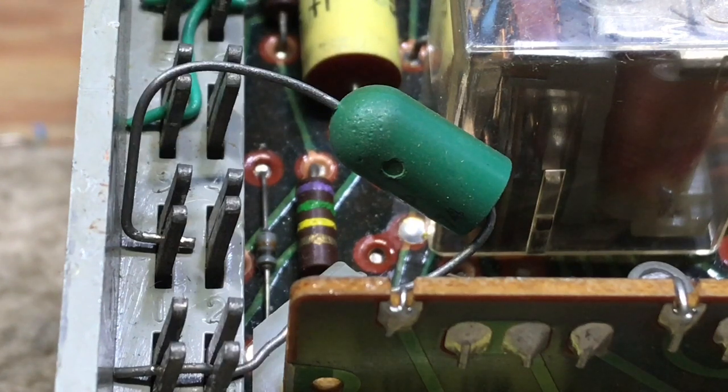Occasionally, a person will run across the 400D KTU that has a capacitor such as what I'm showing right now that was added to the circuit card in the field. This is done only on 400 KTUs that were connected to Centrex systems, basically a number 1 ESS or 1A ESS type switching system. A Centrex, usually for government or business services, would have features on their line such as call waiting, and this would also happen in regular business environments as well. If you had a call on hold and that line had call waiting, the moment that the central office switched the phone line to the 3-port conference circuit to allow call waiting, you would drop the on hold condition, i.e. hanging up on the person that was waiting for you to get back to them.